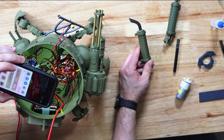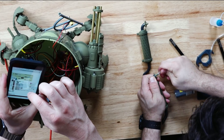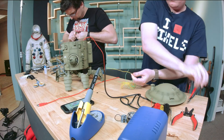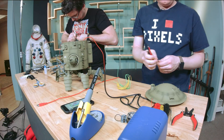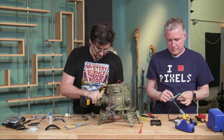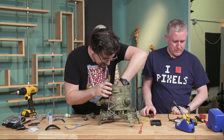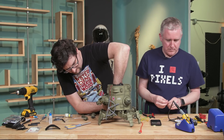The first thing I needed was an available pin on the Arduino. The designer used almost all the pins because there are so many moving parts, LEDs, and things. I found pin 13 was available. If you want to add smoke to any model, you need to find a free digital pin that will trigger a transistor, which will allow power to pass through to the smoke motor. You need an available digital pin, power, and a ground terminal — five volts for power.